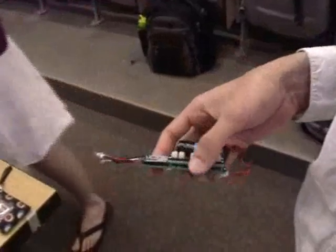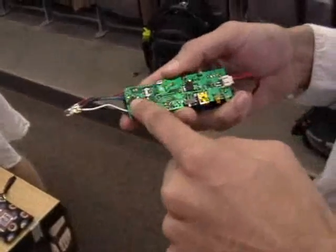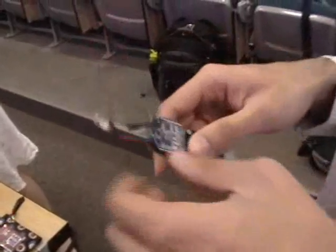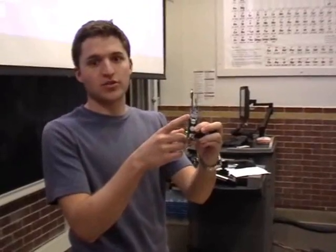The hardware behind our magic wand: it's powered by an ATmega 168, which is underneath the button pad. There's a 3-axis accelerometer on the back. It has a lithium-ion rechargeable battery along with the charging circuitry. We have an RGB LED on the top along with an IR LED for IR camera tracking, and an XBee on each of the wands.